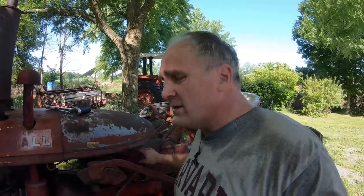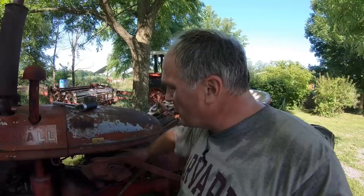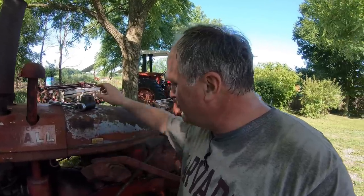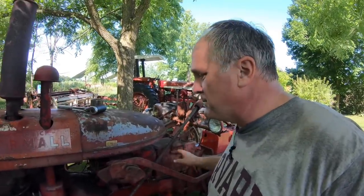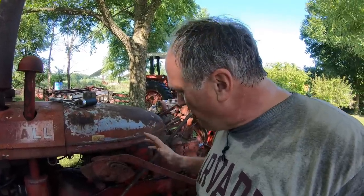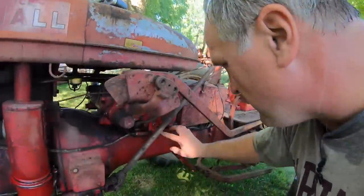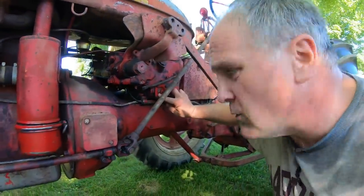This generation of tractors has what's called a touch control system, which is a separate hydraulic block right here. It runs a couple rock shafts here, and then there's a remote that goes back to the hitch. It doesn't have remote hydraulics in the sense that you can hook something up to it. So with these tractors, the checks are real simple. There's a level plug here, and then there's a filter here, which is a washable type.